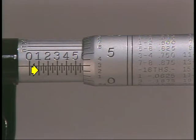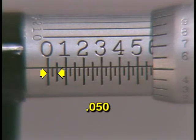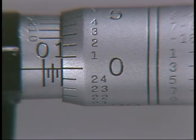Each of these large lines or graduations is read in hundreds of thousandths. Between each of the large numbered spaces are four smaller spaces; each space measures twenty-five thousandths. Moving from zero to the right: the first small space measures twenty-five thousandths, the second totals fifty thousandths, the third marks seventy-five thousandths, and at the end of the fourth space is the large graduation representing one hundred thousandths.